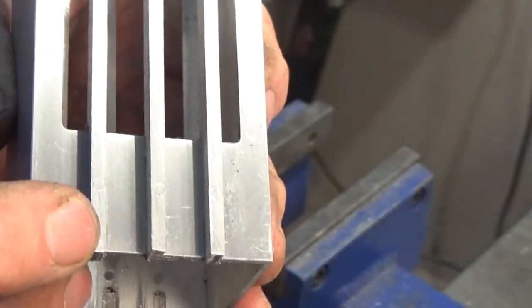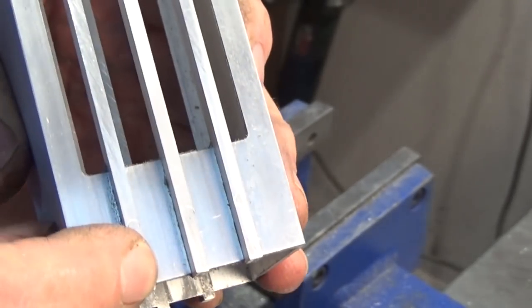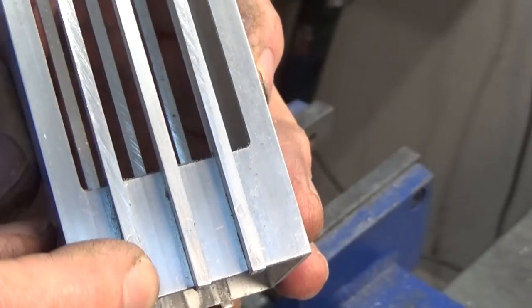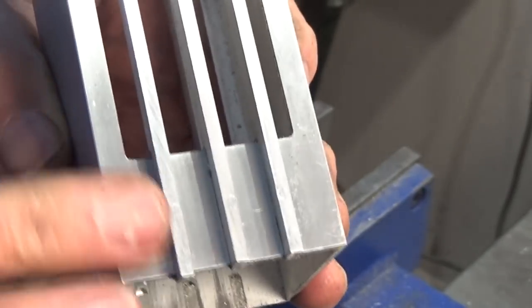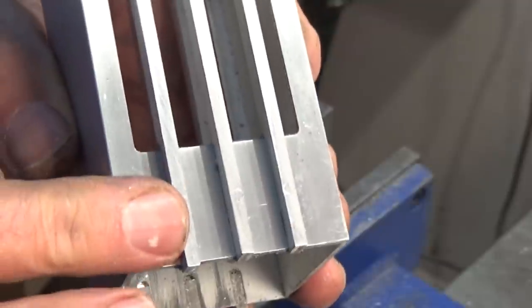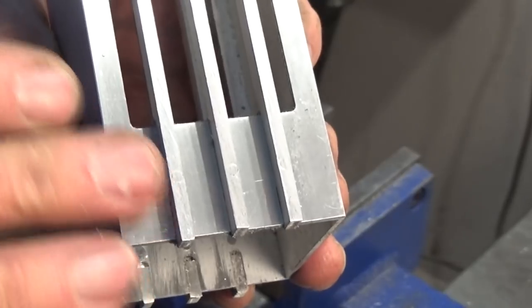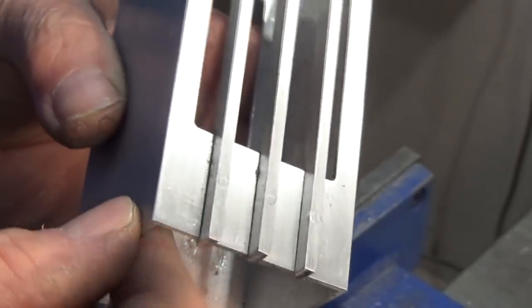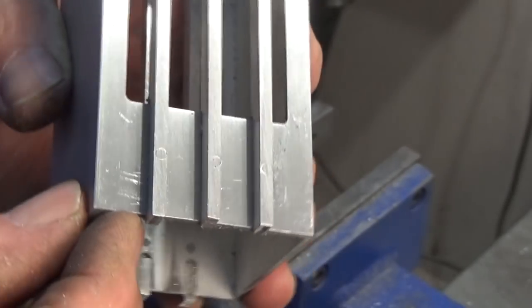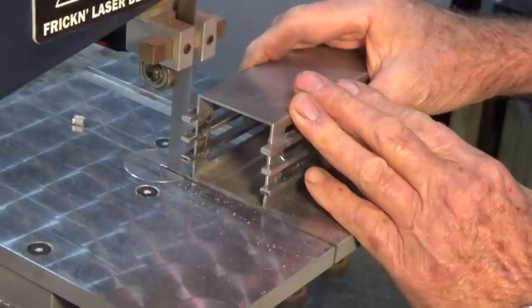Now you can see just a little edge around the countersink there where I've draw filed and polished that with some emery, but trust me, you won't see it when it's powder coated. You're going to use a textured powder coat. It'll easily hide whatever you can see of that rivet there now. But yeah, that's done. So just rinse and repeat now and get them all done.